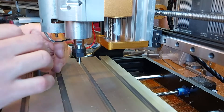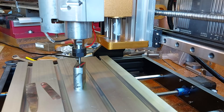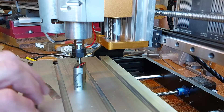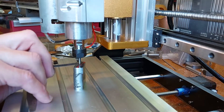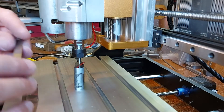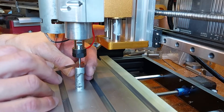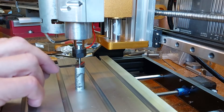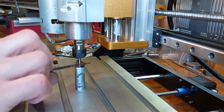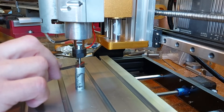I can't get a DTI under here, so what I've got is some blocks and some feeler gauges. I'll just set that slightly down and move this. It's moving at 0.1 of a millimeter. You can just see that gap closing up there and it's just touching. So I've got a four thousandths of an inch thick feeler gauge there — sorry they're imperial but it's just what I have around. You can just feel the point just starting to grab. So I'll swap that down to 0.01 and move it slightly down. I just want to know that I've got a certain feel — it's moving but it's got a little bit of tension. I can feel that feeler gauge now.